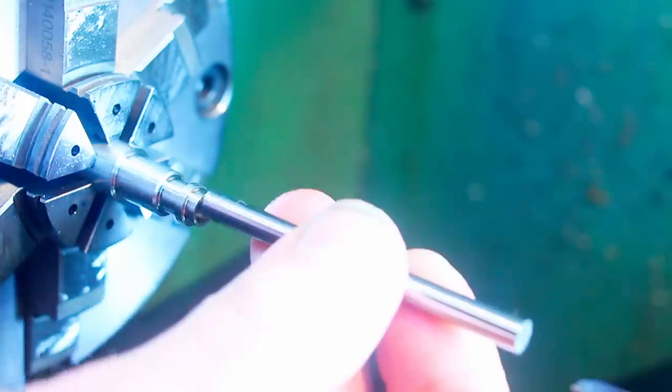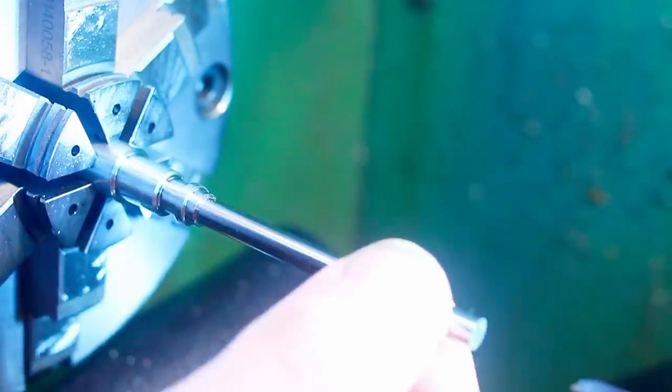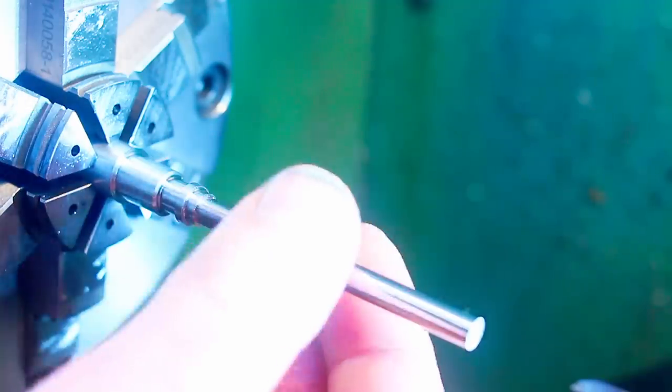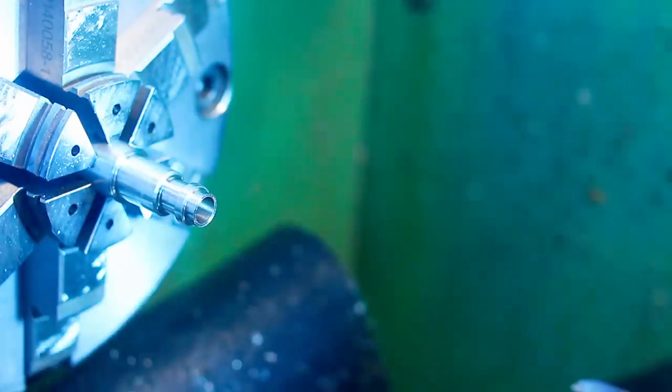This is a 5.6 millimeter pin, lower end of the diameter. This is an extremely close fit. Goes in. By feeling it, it's probably about 10 micron oversize. The 5.7 should not fit at all, yes. And the nominal pin, center of tolerance, doesn't fit. We could leave it like that.